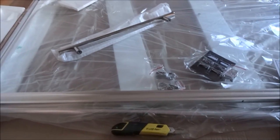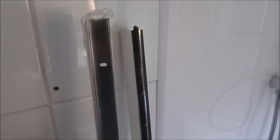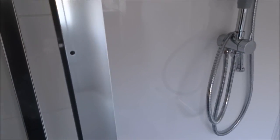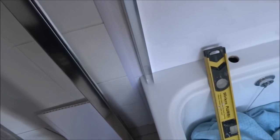The first thing we want to do is get the wall bracket fitted. The inside bit had another component to it which I've pulled out. We lean that against the wall, and this one goes on the inside of the bath side. We just need to line up in the bath, get a spirit level, drill three holes — top, middle and bottom — and then just screw it in securely.